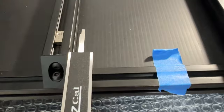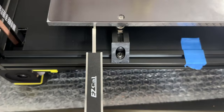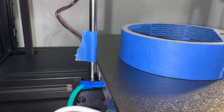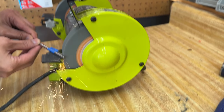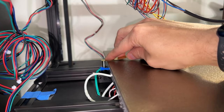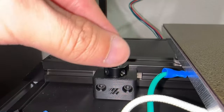As for mounting the bed, I am following the measurements in the assembly manual. The plate should be 38mm away from the front extrusion edge. I chose to fully tighten the front left screw and left the rest slightly loose to allow for thermal expansion. For the Z endstop shaft, I am going to measure the height with the flex plate on. Overcut it and grind it down — you can't do the same if you cut it too short. It should be slightly higher than the build plate so a feeler gauge can't pass through unless the shaft is pressed down. I grind a flat so a set screw will keep the shaft from falling out when the printer is turned upside down.